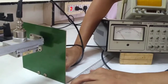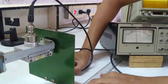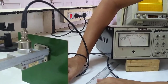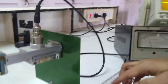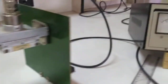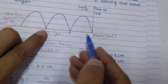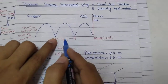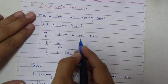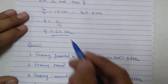I will move the sheet in the forward direction. First I will get a maxima, and then moving further I will reach the minima. The scale now reads 4.5 centimeters. Earlier it was 6 and now it is 4.5, so the difference is 1.5 centimeters. This distance between adjacent minimas gives λ0/2 = 1.5 centimeters, so λ0 = 3 centimeters. Using f = c/λ0 gives approximately 10 gigahertz.